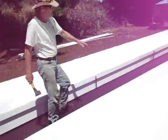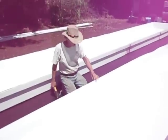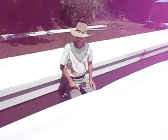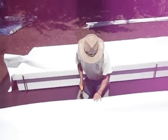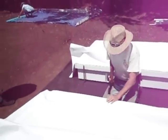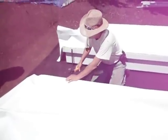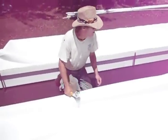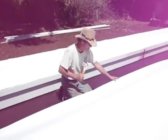Now I'll go right in the middle. I've got it stapled down there and I've got it stapled down there. I go right in between the two. I take this edge, I move it in so it's even with the edge of the 2x4 for one staple. I go in the middle between that staple and the next one over. Push it into the edge — one staple. In the middle between this staple and these — push it in, one staple. Now pretty soon it's straight with the edge, and I'll put a staple in. Check, make sure it's straight with the edge, about every 8 inches or so.